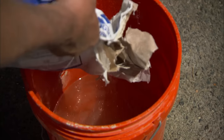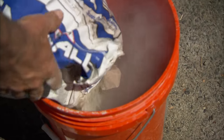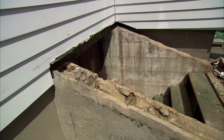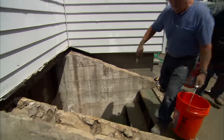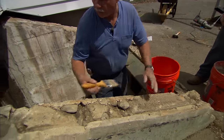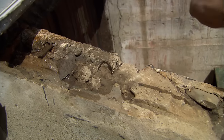This is fast-setting grout, not concrete. Sets up in about 15 minutes and cures in about an hour. All right, Joe, we have everything cleaned up and I look at your foundation and structurally, it's in great shape. Now what I'm going to do is I'm going to wet the top of our foundation, so when we put our grout on, the concrete on the foundation won't take all the moisture out of our grout.